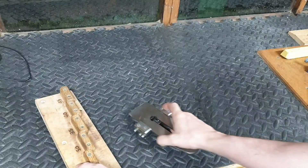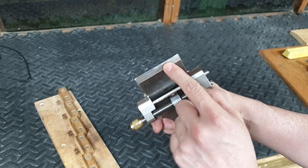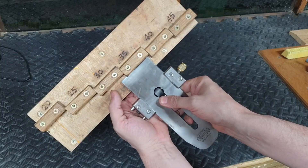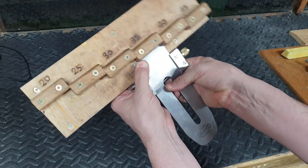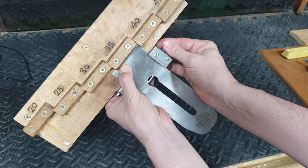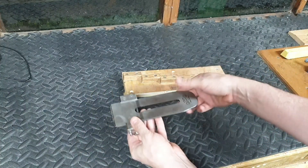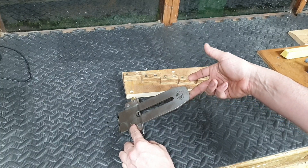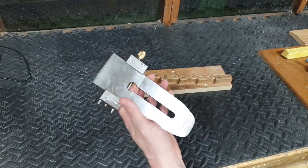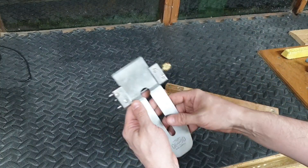Now we're going to select our degrees. I can see there's a rather large bevel on this one — I generally know this is sharpened to 35 degrees. So we get the depth stop, set it to 35, push it all the way up to 35, then push the guide so it's touching the very edge and tighten it up. If I set that on my stone, that is 35 degrees. I know each time I sharpen I can always rely on this, so I can always reset it and get that consistency.